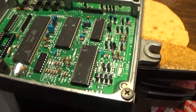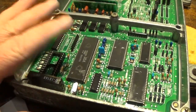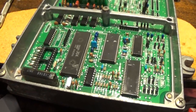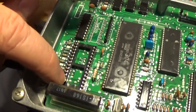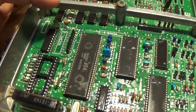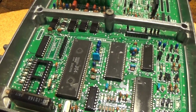Here's another thing — I'm going to need two hands for this. When you're putting components on the circuit board, before you get too far along, you should test them while you still have room. I'll show you some examples of how I test these — I just got done testing all the pins on this connector and these components as well, to make sure I got good solder connections. I'll be right back.